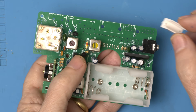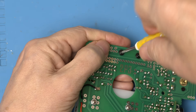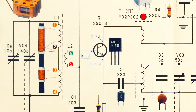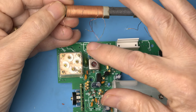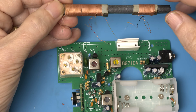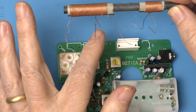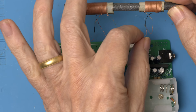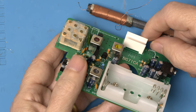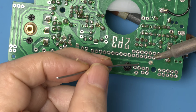Let's move on to the antenna now. First step is to attach the holder, so let's get that screwed in. These antenna wires are very delicate and color coded. One side has four leads, the other side is two. I need a yellow and black for one and two, red and green for five and six, and three and four should be two yellows. I feel like soldering them one at a time so they don't keep moving and falling out.